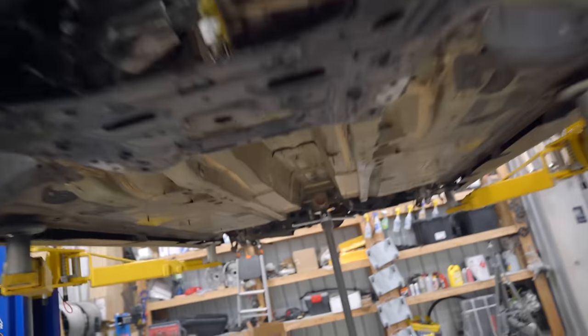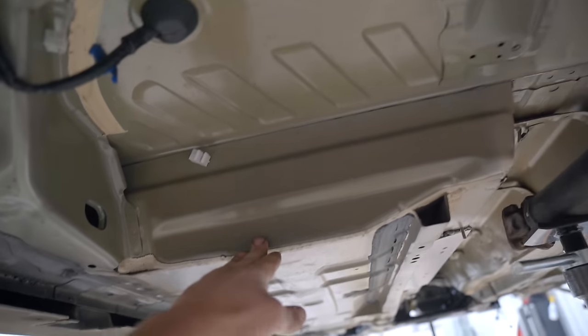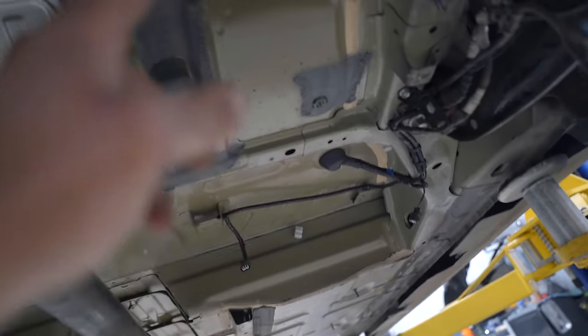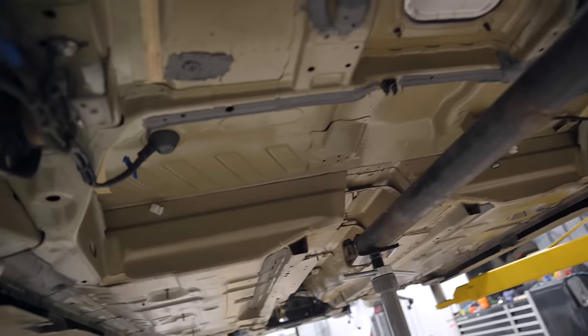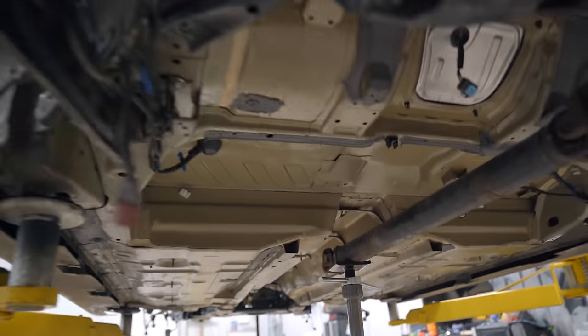We got all the parts installed that we need to build the cells. Rough mock-up of a random drive shaft, rear diff, subframe. Nothing else needs to go in. So the tank is gonna sit from right here and it can come all the way up here. That alone is pretty dang big. And if you look over here on the other side, we get the same exact amount of space. I'm gonna run through and build just one out of cardboard, and then we can duplicate it, build 2 exact fuel cells, and that'll be a massive, massive step forward in the right direction for the build.